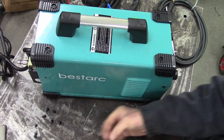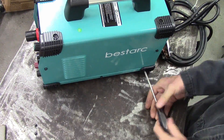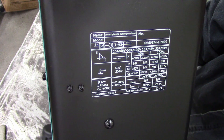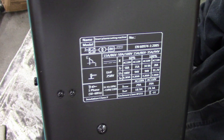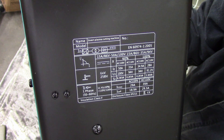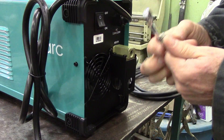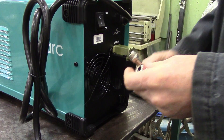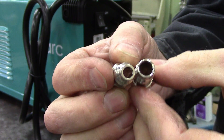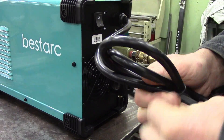I did not have to take the handle off for this — thought I did, but nope. It's not that heavy a unit, so you don't really need a handle screwed to some reinforcement inside. I love the color — it's got like a late '50s kind of vibe to it, a natural pastel. Duty cycle is important on a machine. If you're going to run full throttle, you can only get 60% duty cycle. But if you're willing to knock the power down to like 75–80% of full throttle, you can get 100% duty cycle. 34.9 amps on 220 would do you. This is an M fitting — the most common type — but I use a V fitting, which is significantly more flow, so that's the one I'm putting on. If you have the choice, run 220.